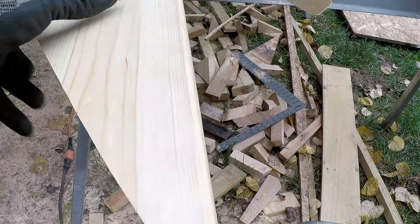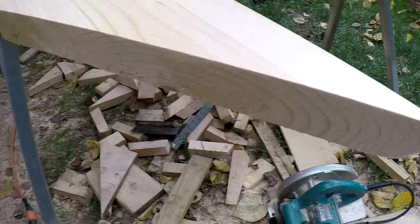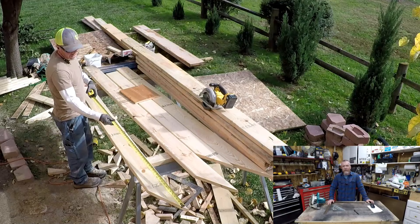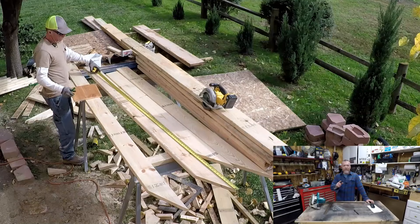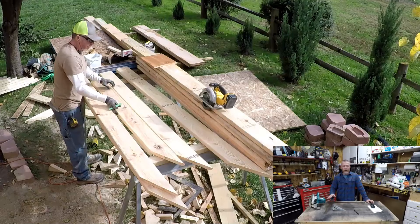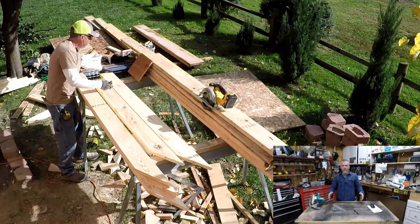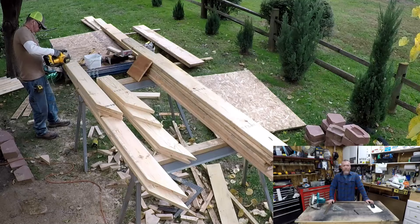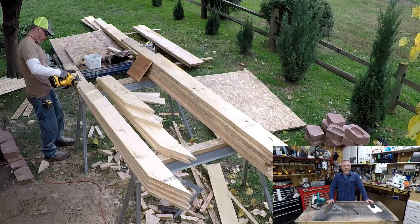You can see I just stacked the rafters because I've cantilevered them — I just didn't want them to tip over. So you make all those cuts. This is actually the leftover cut. When you cut all of one side, that leaves you the cuts for the other side. You're going to pull from the long point of that beveled cut and mark your six at the other end for your ridge cut. This will be the side you see installed. And if you have long enough stock, when you cut your first long rafter, it leaves you your short rafter — you just invert them. That's why you use two saws: you don't want to have to change the bevel constantly.